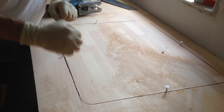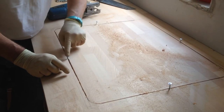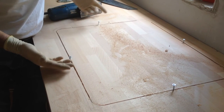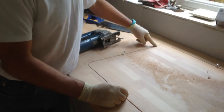I'm sure most of you already know that — but here's the secret: put four screws in, quite a long way. Obviously the edge of the sink is going to cover it, so any minor damage you won't notice anyway. Then you can just cut the last corner, which I'll do now, and then I'll bring the video back online. I'll see you in a sec.